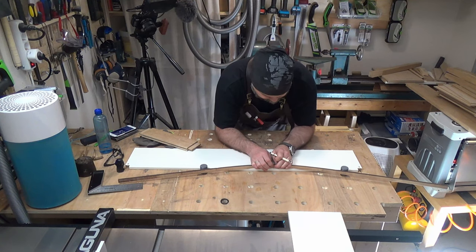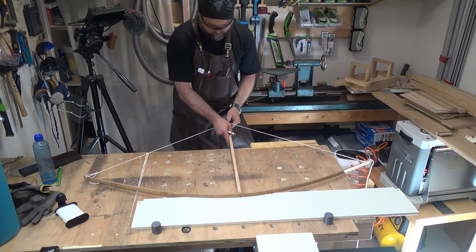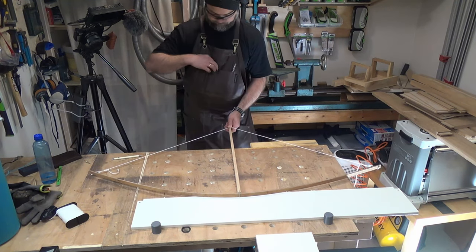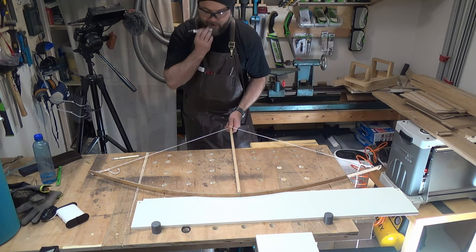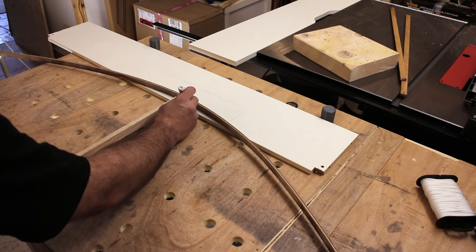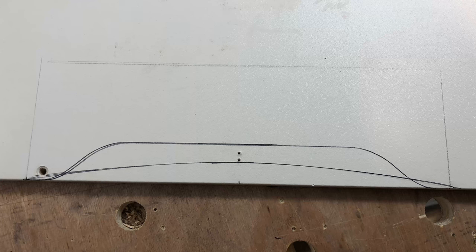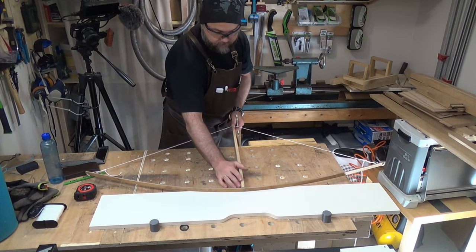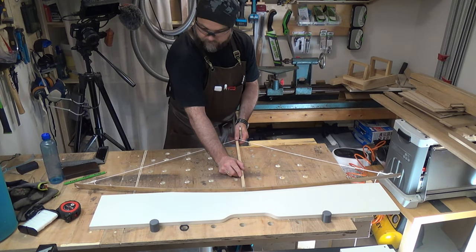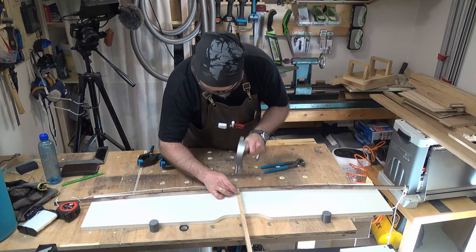So after having learned this, I used a thin strip of 6mm plywood. Bending it by hand didn't really work, so I tried the YouTube crossbow trick, but getting both sides of the arc to bend the same was not that straightforward, but I got it to work for the small arc. For the big arc, however, the plywood didn't have enough spring, so to speak, so I tried bending it backwards, but that didn't work. I couldn't get the same bend on both sides.